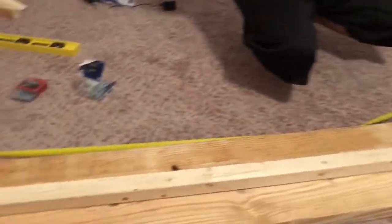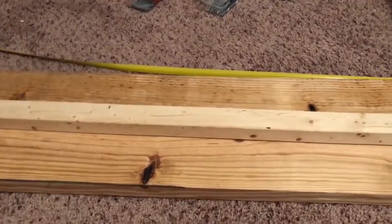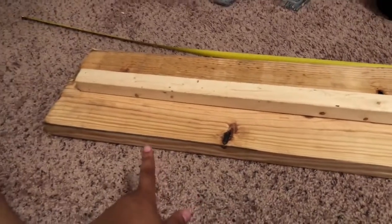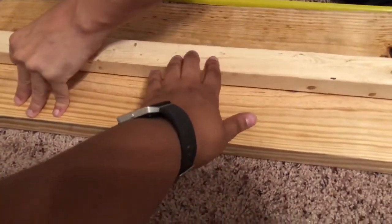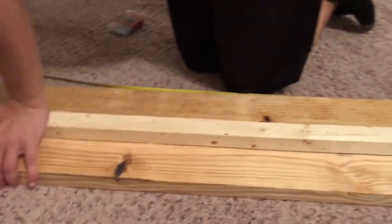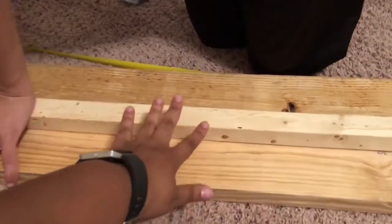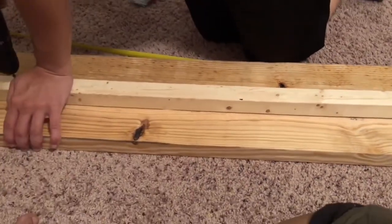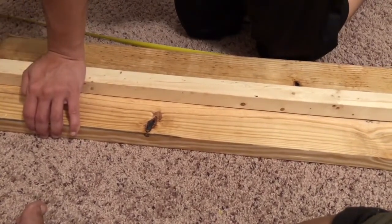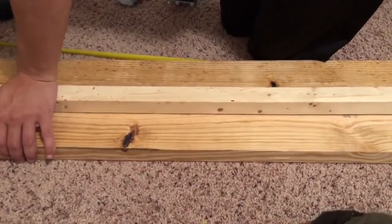Now for the side rails — you're going to connect these so that the headboard and footboard connect to each other and you can put your mattress and box spring in. Measure how high you want your board. I'm going to try to get Mike to write more detail in the description box about the exact measurements. Right now he's pre-drilling holes so he can screw them through the board. I think he did ours at halfway — about six inches — so it would be ten inches off the ground.